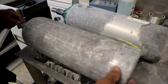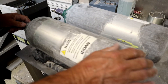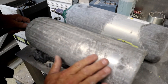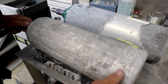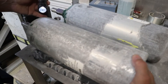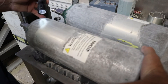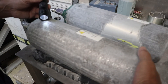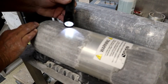Let's get a closer look. I've scraped all the corrosion and hit it with a wet sanding sponge. Now I'm rotating the tank around and looking for any kind of pitting — anywhere the metal has been eroded or corroded away. Putting a flashlight across the walls of the cylinder helps catch the shadow of a pit. It might be small or shallow pitting where your eye doesn't catch it right away, but a flashlight will reveal groupings of very shallow pits.